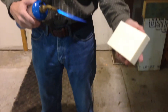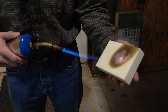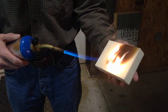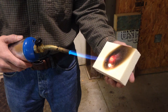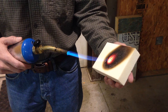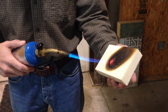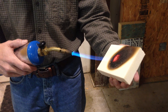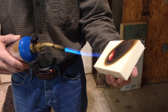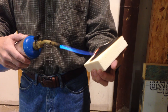Now, this is our closed cell polyurethane foam. What it does — it'll flash initially, and then it basically seals itself off. I can hold this torch on here all day. This is 3600 degrees Fahrenheit, 2000 degrees Celsius, and it's just about one inch thick — two and a half centimeters. My hand is on the other side here, and my hand is not feeling any heat from this torch.